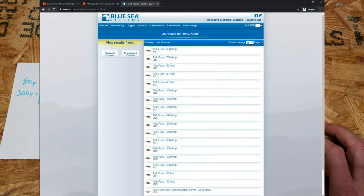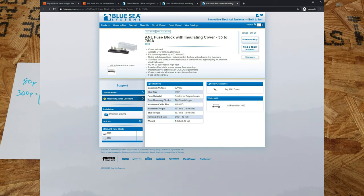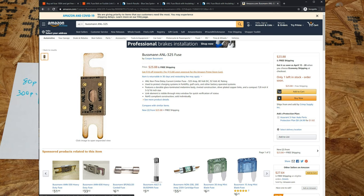My favorite go-to for fusing has been Blue Sea Systems — high quality products, most of which are rebranded. On their website they have fuse blocks for 35 to 300 amps and 35 to 750 amps. Unfortunately both are rated for systems up to 32 volts DC, so they won't cover a 14S battery pack. Here's an example of the fuses you should be looking for: a Bussman ANL325, a 325 amp fuse rated for 80 volts DC or 32 volts AC — a good choice for a 48-volt battery bank. Make sure you're buying a genuine fuse.